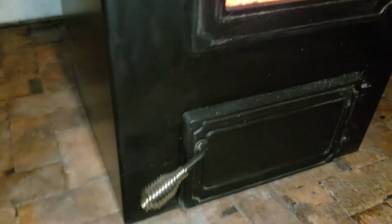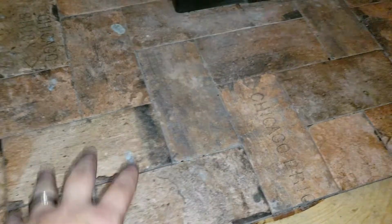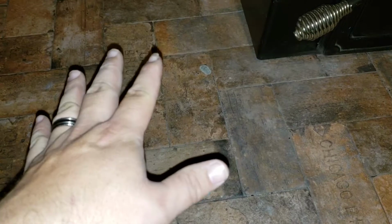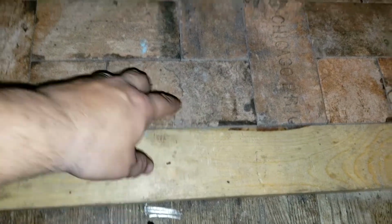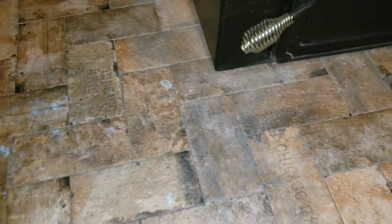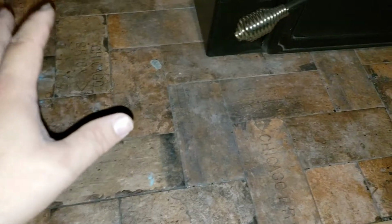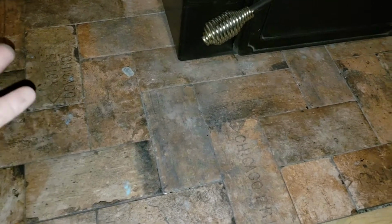You don't want that. So I ended up getting this nice little designed Chicago style brick. Underneath that, 1/4 inch thick, like a concrete type thing they put for flooring and stuff. I put that underneath it, so it's roughly about that thick of stuff. Now, I did use just a cheap board right here for now, but I'm not worried about that. So it's definitely good. You can go thicker, you can go a full thick brick, whatever you want to do. You just want to make it safe for you and your family, or just you, depending.